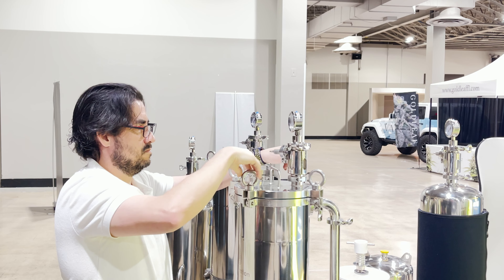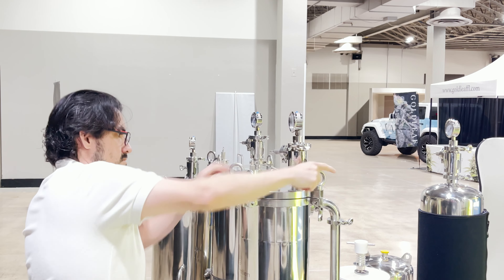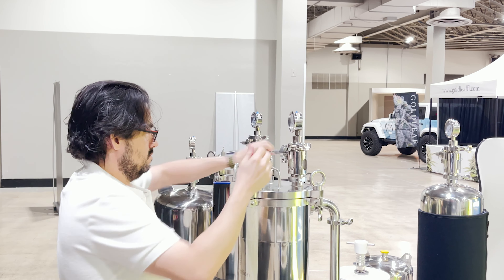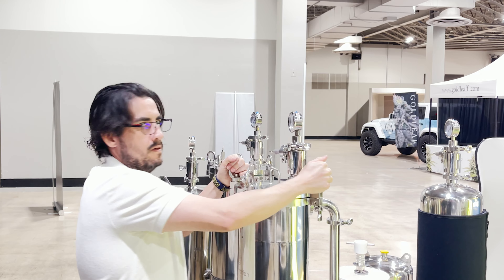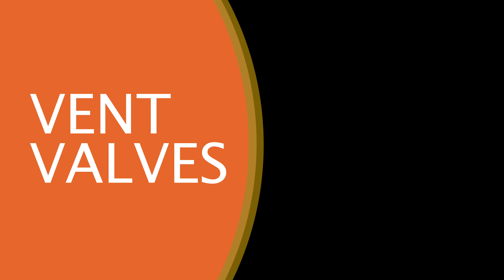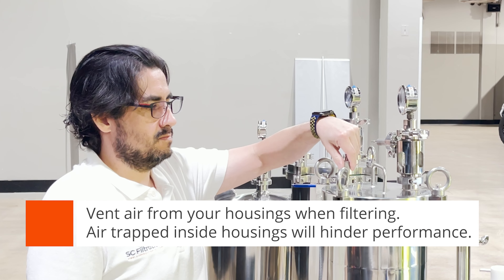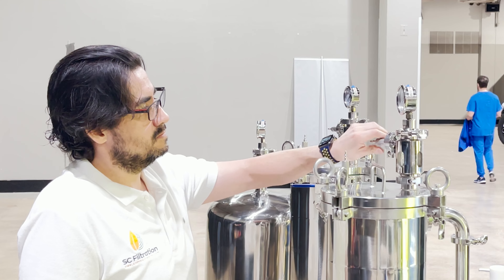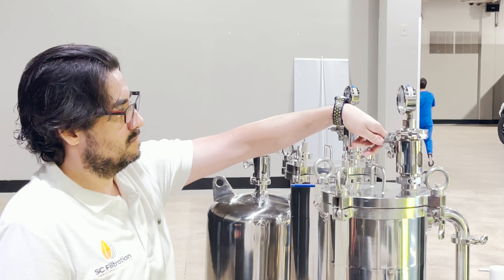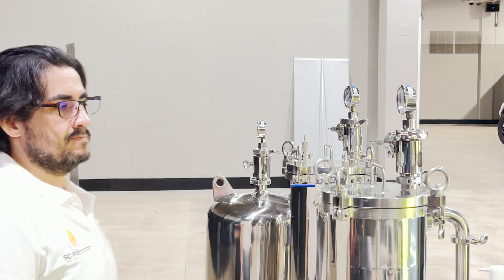This needs to be nice and snug — you don't have to overdo it or go crazy on the tightening. Every filtration stage has vent valves, used either to vent air from the system as you're filling, or to inject compressed air to drain the system efficiently. Every stage also has a sight glass so you can see what's going on, and you can verify the operating pressure at each stage with the pressure gauge.